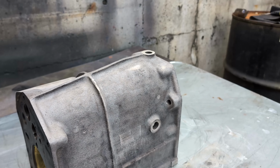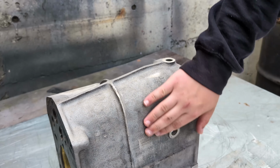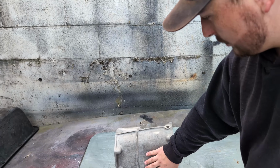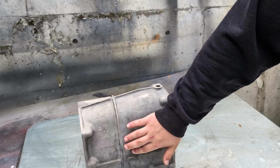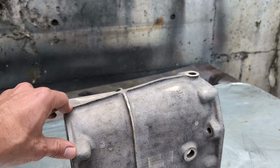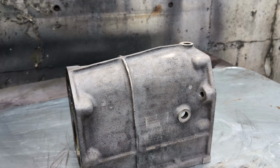That's a good point. And then Nathan, you were talking about how you can actually slightly etch the material, which makes it even better for paint. Yeah, so depending on surfaces, sometimes when we want to paint a part, we want to actually scuff the surface and make sure we have proper layer adhesion for that paint. So we can tune it to actually do a uniform pattern. So instead of having a nice polished part where paint won't stick, you'll have a nice keyed surface for your primer. Yeah, and this is ideal, really, seeing the metal down to bare like this, so it would be etch primed and polyurethane coated ideally, but now it's ready for whatever refinish process you want to use. Yeah, really well done. Congrats, guys. This is blowing me away.